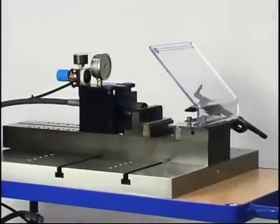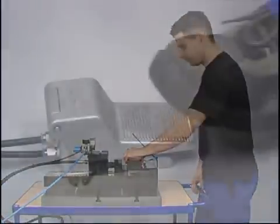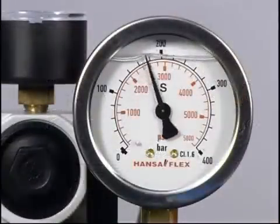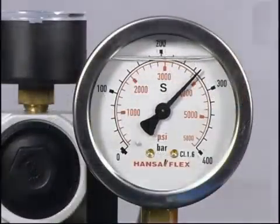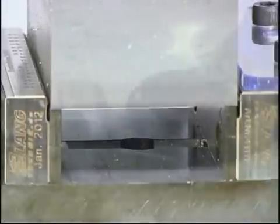The basis of this form closure technology is a stamping system. The workpiece will be stamped with up to 20 tons of pressure using a separate stamping unit, with pressure depending on the material. The pyramid-shaped holding tooth can provide a much better form closure due to the high pressure stamping.